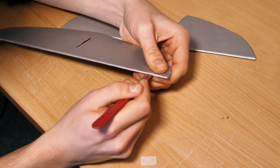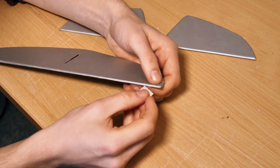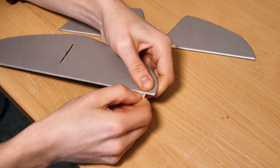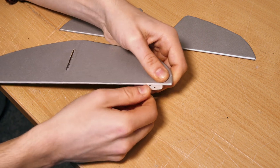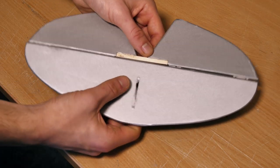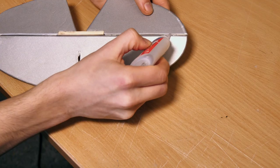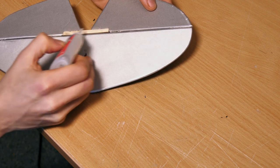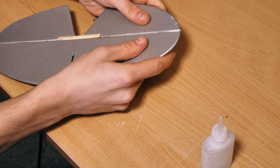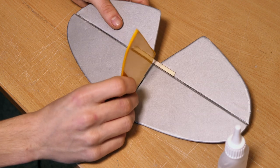The hinges are very carefully spliced into the sheet wood by carefully cutting slots with a knife. When you have matched the hinges to the slots made on the opposite piece, you can slide the two together and run some glue into the gaps. The same process can now be carried out to articulate the rudder.